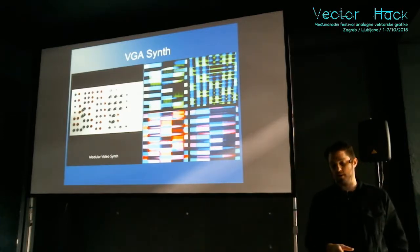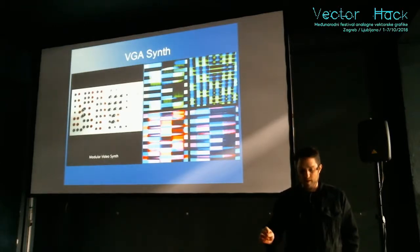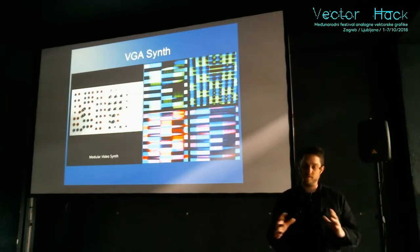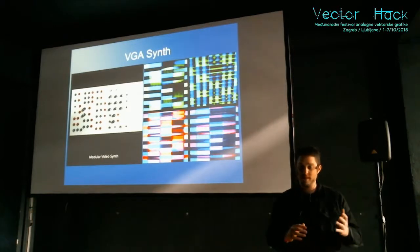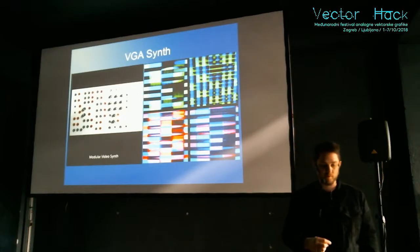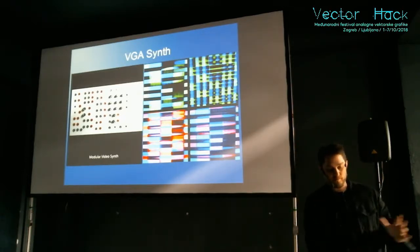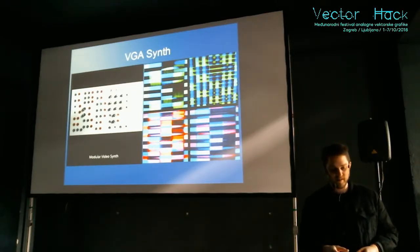Around this time, I contacted Richard Monkhouse, who had designed a video synthesizer for EMS, and he sent me the whole service manual for the Spectre. That's when I started getting more ideas of the concepts of a video synthesizer, like ramps and shape generators and how you compare those ramps to make shapes on the raster. But it was a lot of CMOS circuits in there too. So this was trying to be my version of a Spectre.